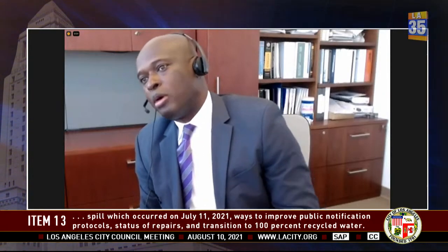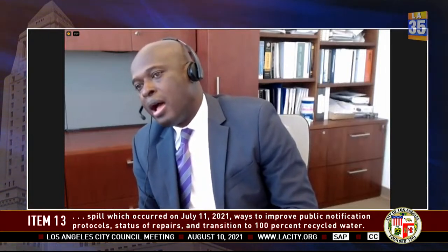But in the larger context of the Hyperion 2035 Operation Next, we're also looking at what will modernize the plant. We're going through these studies now and trying to look at how we can potentially fast track any kind of designs. But what that program will do in terms of bringing resiliency for water recycling to the city is, in addition, it would phase out something like the giant clarifiers, which are the circular ponds that you see on site, which take about 2 million gallons each, and we replenish those 3 times a day, and there are 36 of those. So all that will be gone, and those were one of the areas where sludge was being stored that created the odors.